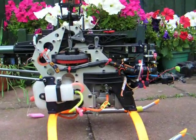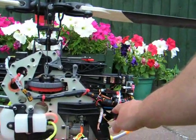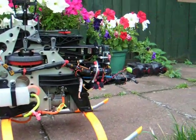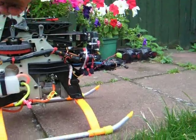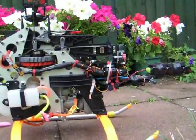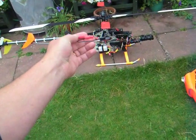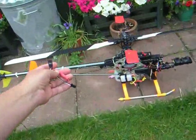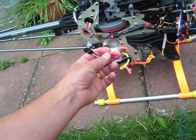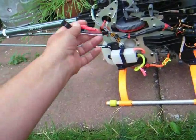They sit there and they're big amperage, so they don't get warm at all — they can handle the amps going through to run the fast digital tail servo and power the gyro. If you have a full digital setup on a 90, rated only 4.8V, you've got to look into it more carefully because even big diodes can get hot with the amperage going through all the servos. You can buy pre-wired units — the diodes are in line on the power side of the cable and you put this in line with your tail servo or gyro. The reason I haven't used this unit is because these are small diodes, and the current can vary. If you're up for 10 minutes with the tail servos banging away, these can get really hot, and if they fail, you lose all the back end.